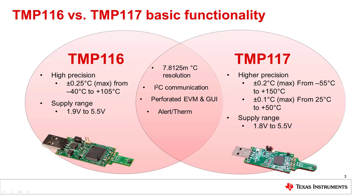Therm mode makes the device behave like a high limit threshold detector by triggering the high alert flag when the temperature has gone above the threshold. These temperature limits can be set by writing to the high and low limit registers. The devices also have user-programmable EEPROM that can be used to store power-on reset values, with four 16-bit locations for general purpose use. Another feature which differentiates the TMP117 is the addition of the temperature offset register, which allows the user to pre-program an offset added to the temperature result after linearization, eliminating the need to write additional lines of code.